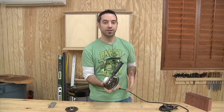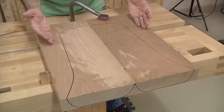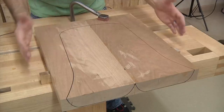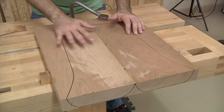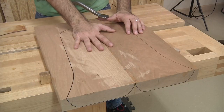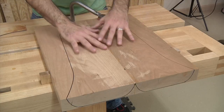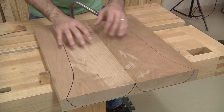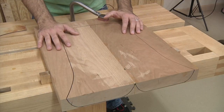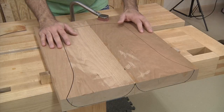So that's what this is — I'm going to do a practice run making a chair seat. What I've got here is a seat blank made from eight-quarter alder, two boards basically glued together. I haven't really done anything special other than just gluing them together. Alder is fairly inexpensive around here so I don't mind using it for practice. If you are going to build anything like this — any type of curved or carved work — you really do want to have a couple of practice sessions before your actual work piece, and that will give you a much better idea of what to expect.